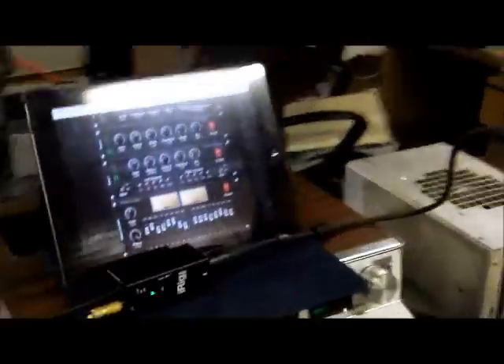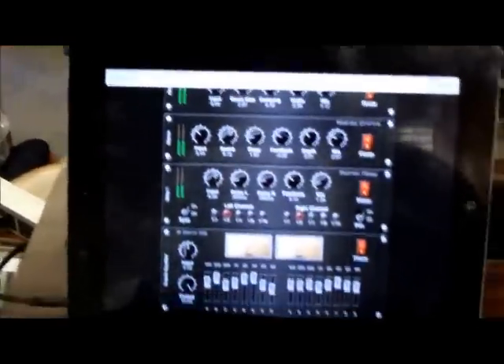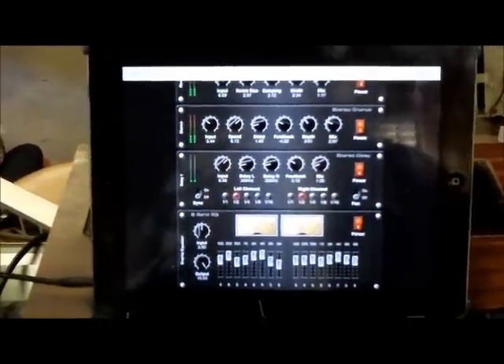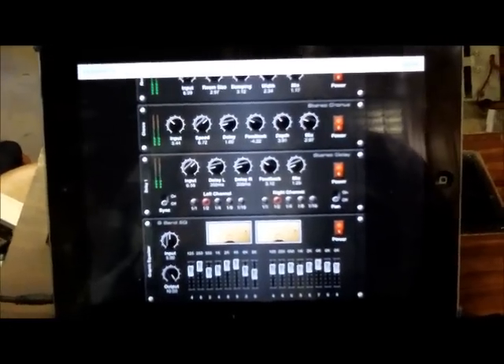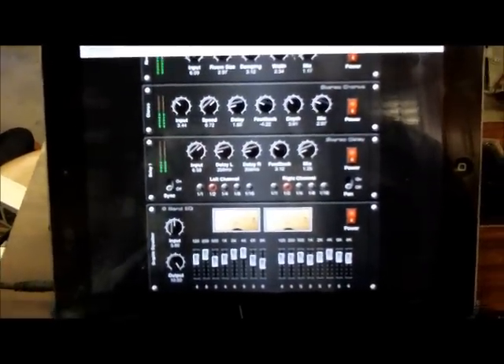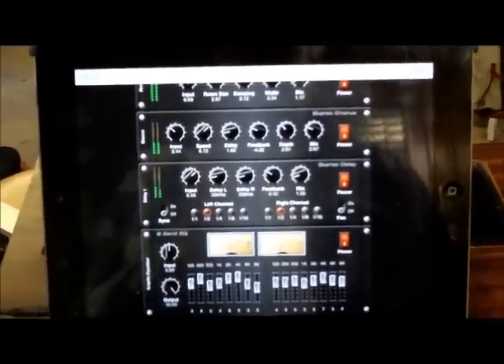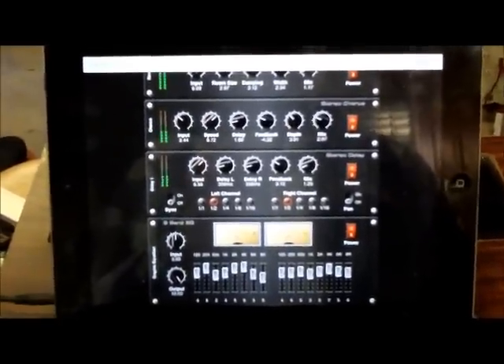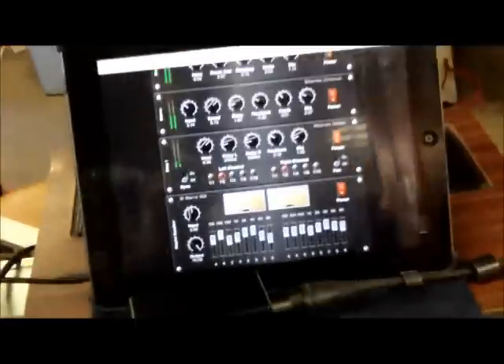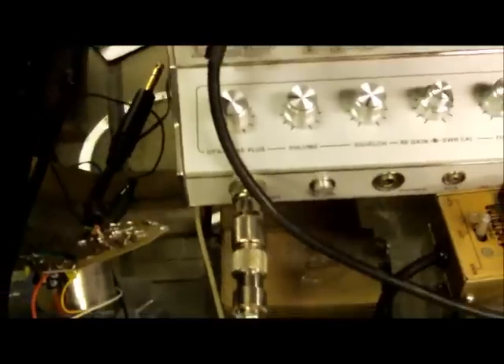I've been experimenting a lot with this app — I tried it in my Motormouth modulator and it worked really great. I did try it with direct inject on the Yaesu; it didn't have enough drive for a direct inject 148 or my 142 — you'd probably have to put a mixer in front to get the drive you need for the audio circuit. Other than that it worked out pretty good. The best way to do this is definitely right through the mic the way I have it here.